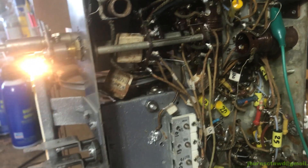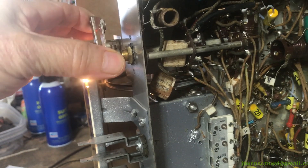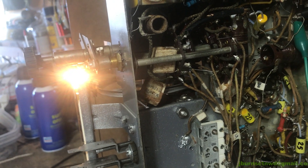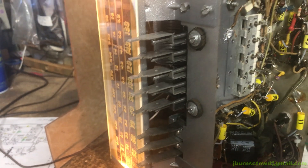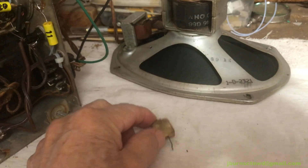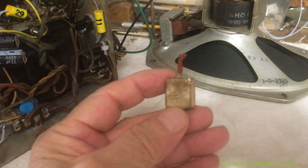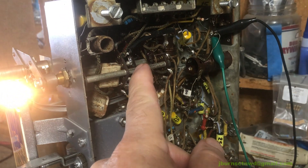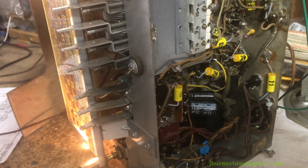I had to clean up the switch a little bit more on the one wafer that handles the band spread switching. After a couple of flicks back and forth I managed to get it to work, but tuning higher than 9.65 or 9.70 I would lose it — anything above that and I would never get it back tuning the other way. I managed to trace it down to this capacitor. This is a 160 pico and that one there is a 151 pico — it might be 10% off one way or the other — but it works.